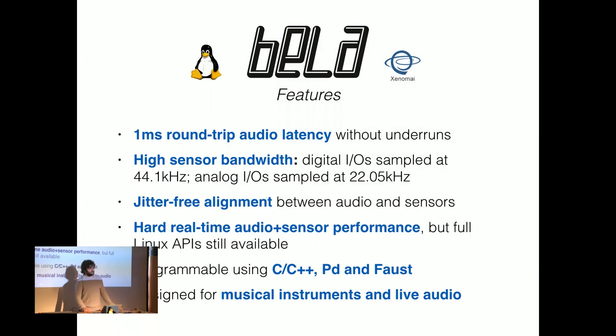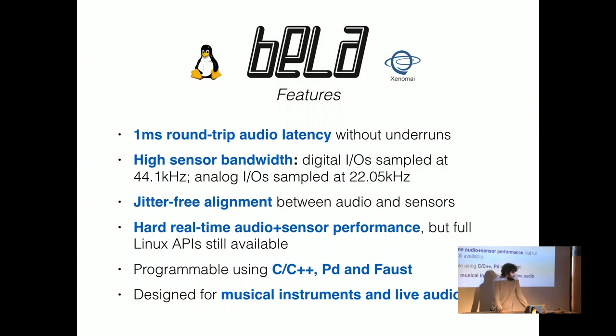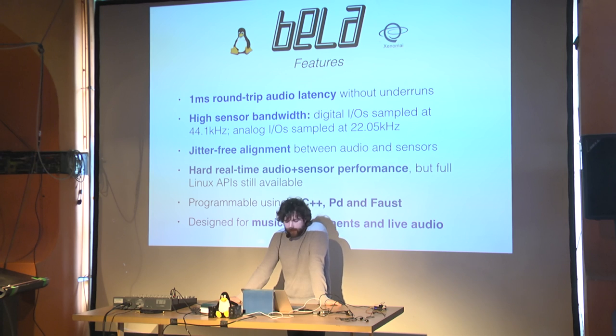There's a custom software environment matched with the Cape, based on the design of the audio Cape for the BeagleBone Black, but it doesn't have an ALSA driver — you can't use it as a regular audio interface. This is because we bypass the audio kernel using the Xenomai extensions to give the audio thread a much higher priority than the Linux kernel, so you can't go through ALSA. This allows you to achieve a buffer size of two samples, bringing round-trip latency below one millisecond. That one millisecond is mainly due to filters in the converter; for the analogs you can get below 100 microseconds.